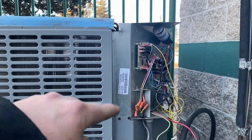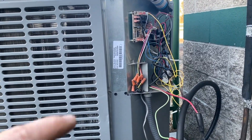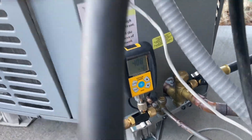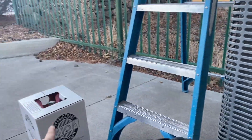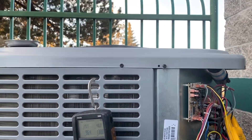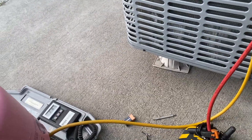Back from lunch, just started putting stuff together. I already mounted the bulb and I'm insulating it. I put on the coil sensor for the defrost. We're at 408 microns — it's looking good. We've got our refrigerant and we're going to charge her up, hopefully it works.